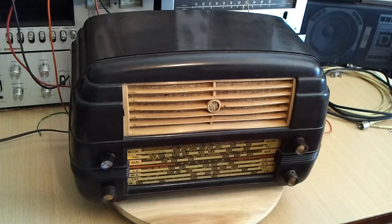So I've started replacing a lot of capacitors in it — a lot of paper capacitors, some of which had their cases cracked, and a few electrolytics. And it's going again, as you can hear.